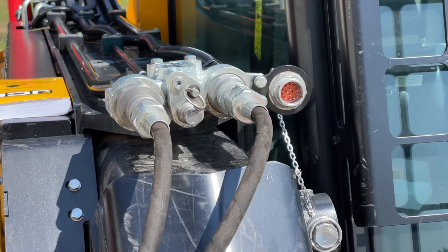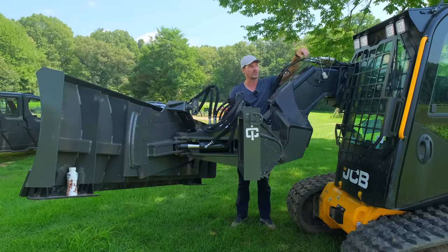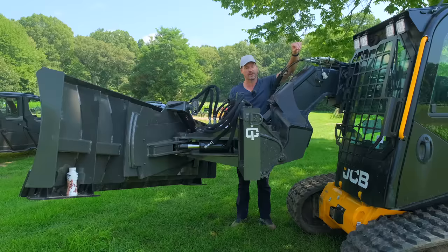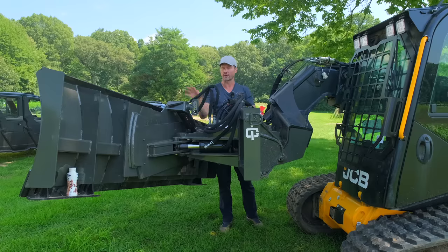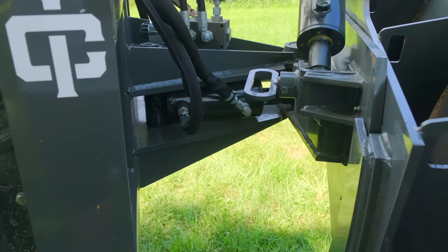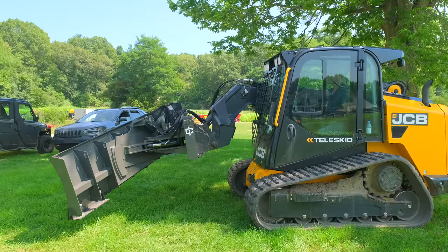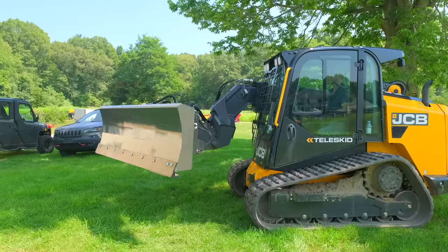This one over here is going to be your electrical connection. This is a 14-pin connection — we're actually only using two pins in this. At the time when I ordered this I wasn't sure what machine I was going to use it on, so there's just a little pigtail here, a harness. There are a whole bunch of different ends that would plug into there depending on what kind of setup you had. There's only two pins that are in use here: a ground and the positive, and that's all you really need. All that stuff comes back down over to here, and you can see all these different hoses that go to different cylinders. You're going to have a cylinder that does the tilt rotation, and two cylinders that handle the angle — left and right angle — and that all comes back into this solenoid block here.